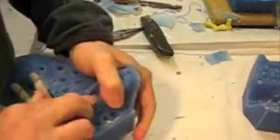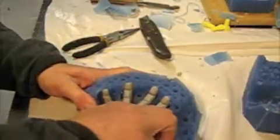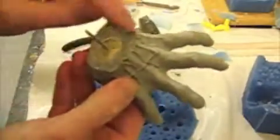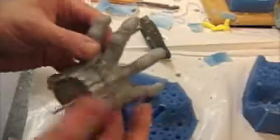Now, let's get our finger under there. Let's see if we can pull this out without damaging it any further. And it looks like we should be fine. Okay. As you can see, the air traps we put on there, which were the toothpicks, are still inside the mold, along with our pour spout. So we're going to put the sculpture carefully to the side, which we'll repair later.